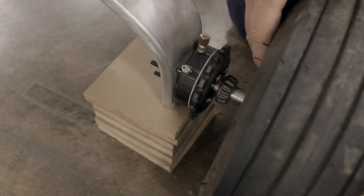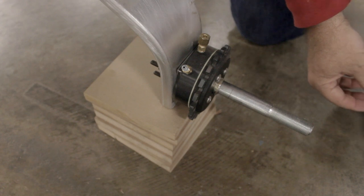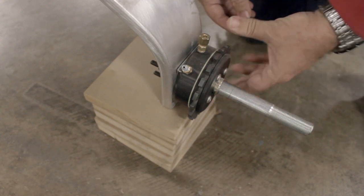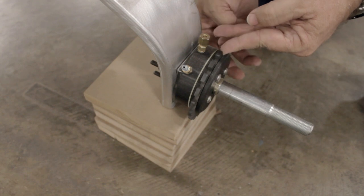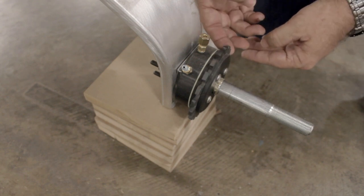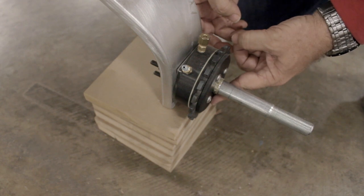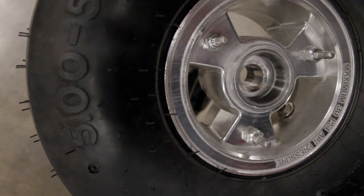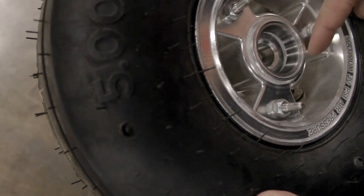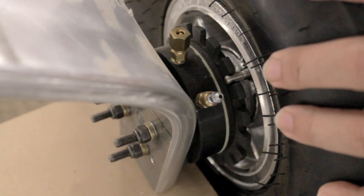I've been asked to explain a little bit more about the brakes on the Thatcher. The Tracey O'Brien brakes are a different unit - instead of a rotor attached to the wheel and a caliper attached to the landing gear leg, it's a unit that is basically all self-contained, attaches to the wheel strut with the rotor encased inside. It can spin freely until you put pressure on the hydraulic fluid and it clamps down. It's basically just a bunch of tabs on the outside. The axle goes through the center, and four bolts attach the axle and everything to the gear. The three bolts that attach the two wheel halves together are provided by Tracey O'Brien, and on the other side they have large hardened steel pins that, as you slide the wheel on, engage those tabs on the rotor. When you apply the brakes it slows the rotor down and thus slows the wheel.